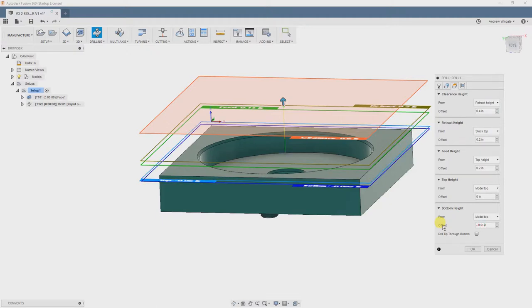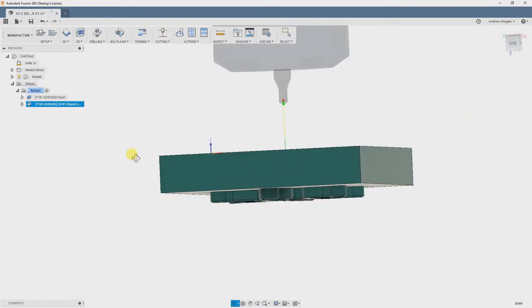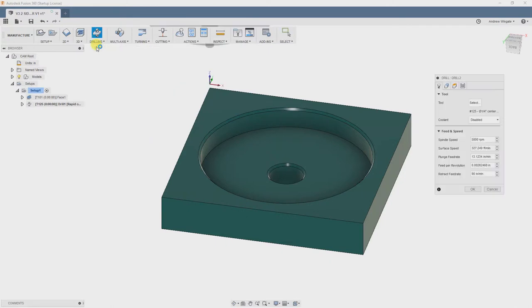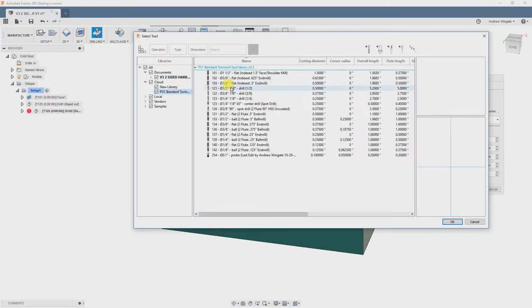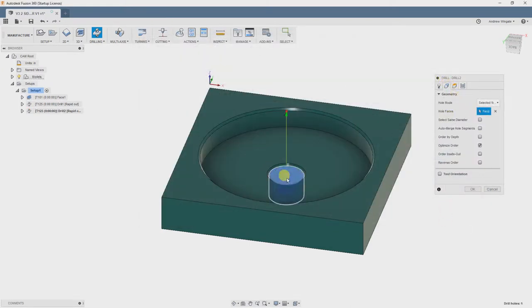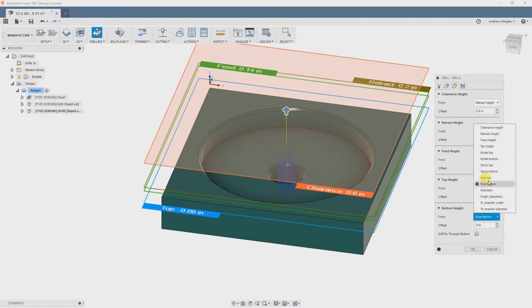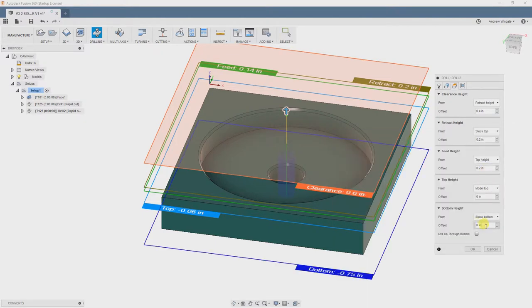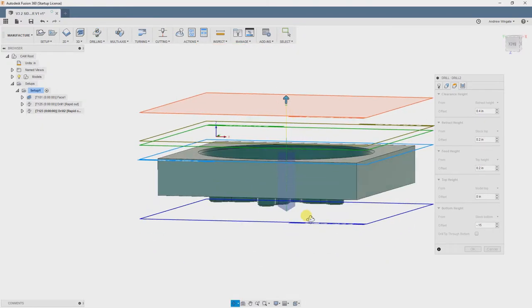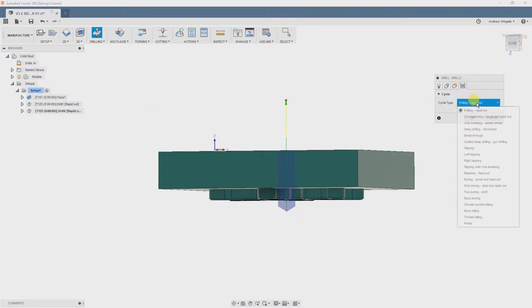I select the Cycle tab — it's just muscle memory, and it's a good habit to get into to select every tab and make sure that everything looks good. Again, we will be drilling, so we will select Drill and choose our next tool, which will be a quarter-inch drill. Select our surface from the Geometry tab and move to the Heights tab. Again, the geometry of this surface doesn't match the amount of material that has to be removed, so we will define the top height as material top. But this time for bottom height, we will be going all the way through the part. So we will select Stock Bottom, remembering that we left 15 thou down there for our next operation. We also want the drill to poke all the way through the bottom of the part, so we will give this operation an offset of an extra 150 thousandths.